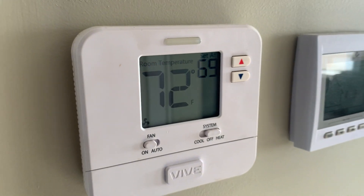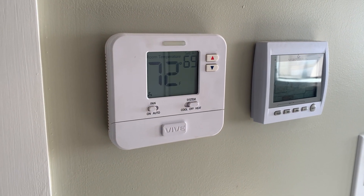A passive solar house utilizes the sun in the wintertime for heating, and it protects the structure in the summertime from overheating to keep the house nice and cool. If you're building something, you're spending the money anyway — it costs no more money to do it properly. This drastically reduces our heating bill to almost nothing, and our cooling and air conditioning bill to next to nothing. There's no moving parts or anything to screw up. It's all in how you situate it and how it's designed.